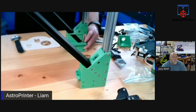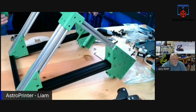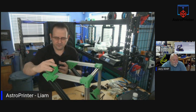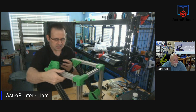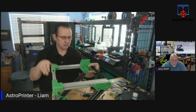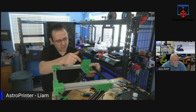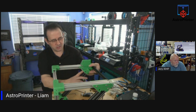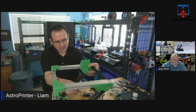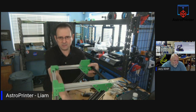There are pulleys that we mounted up here, and on top, I can probably do that now. I have a motor mount for this stepper motor that will be mounted up here. And this stepper motor, let's spin it around with you. This stepper motor, which will be mounted here, will drive a gear that will go to an idler with a small belt. And then there's an idler that goes underneath here, in here, that drives this shaft off that belt. It will be a shaft going from side to side, and from there there'll be belts moving the X gantry up and down on Y, because this becomes the Y axis.